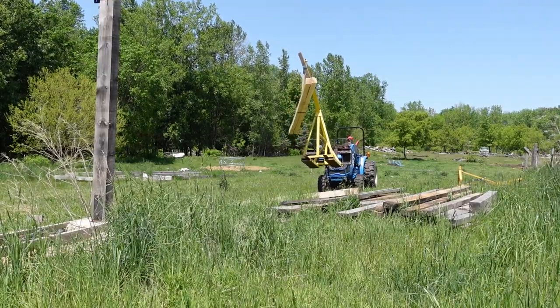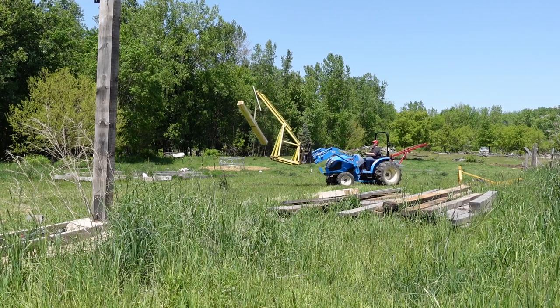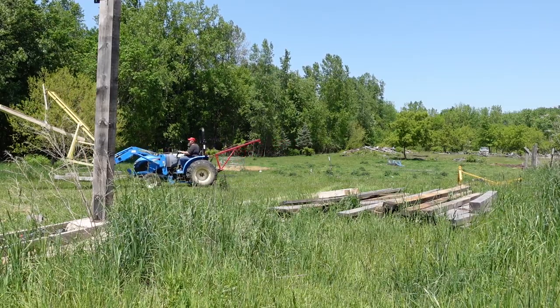That's a lot of times what farmers would do in timber framing when they built their barn. If they were unsure about the species at all, they would just make the timbers a little bit bigger. So we're going to put a single layer of probably a mixture of cottonwood and ash and maple — it's just the stuff that we've got in the woods.